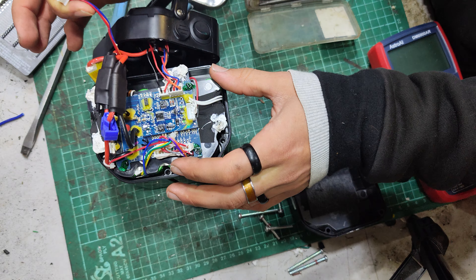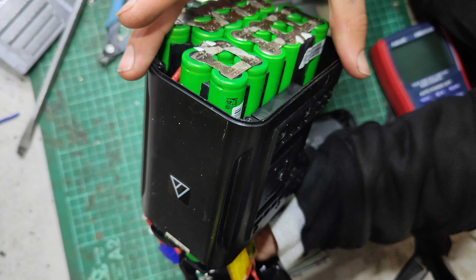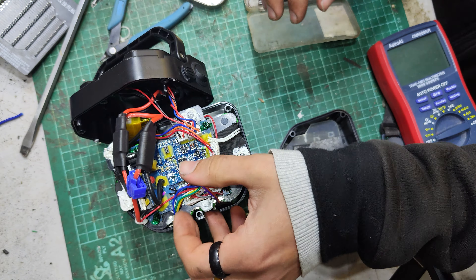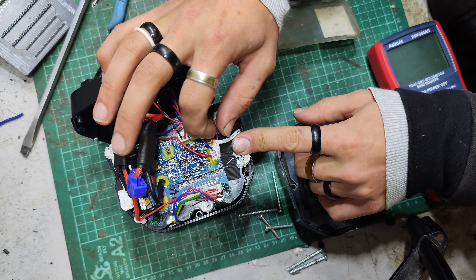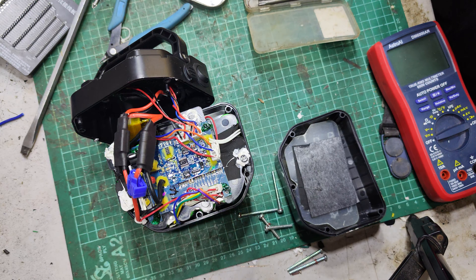18650 V3 — not too sure what that is, but I'm pretty sure it's a Sony cell given the colour. If it was an 8.8Ah pack, there'd be 2.2Ah cells each, because it's a 10S4P configuration in there. It looks like we can resell it. There are extra communication wires that go to the output here — I don't know what they do. If the BMS turns back on and that all works, fine, we can reuse it. If not we'd have to replace the BMS and not use these. I'll have to have a look at the bike and try it with a different battery to see.